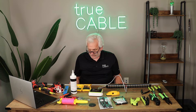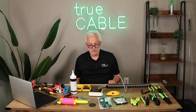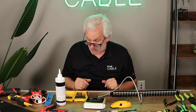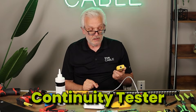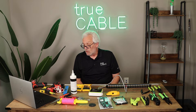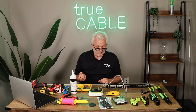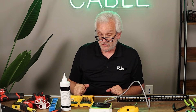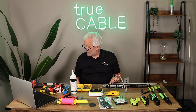It's important to know whether your wires are in the right place — you'll terminate to either the 568A or 568B color sequence, and it must be consistent throughout the project, otherwise you'll get crossed wires that won't work. A simple continuity tester like this will show wiring errors — if a wire is going to the wrong place. However, it won't catch everything; a wire making a poor or intermittent connection might pass this tester but fail a certification device like a DSX-8000.